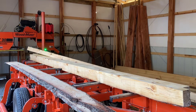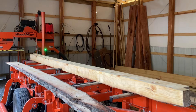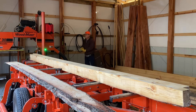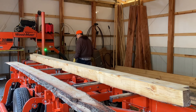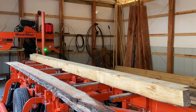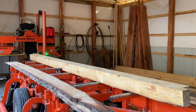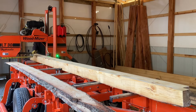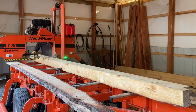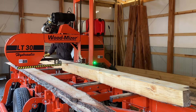Of course these are full 16 foot long, so they're not too hard to bend back into straight. I doubt you could go to the lumber yard and buy 16 foot four by fours that were any straighter. Cutting those top ones off the ones that are left kind of relieved the tension in those as well - they've crooked just a little bit on me. Fortunately I've got a little material left in them that I can trim them down and get them back before I size them to the final size. I released the clamp and tightened it back up because I wanted the cants that are left to relax and not be held down by the clamp on the mill, so they do what they want to do - that way when I clamp them back I can trim off how they're going to be without being fastened to the sawmill anymore.